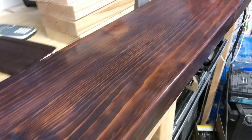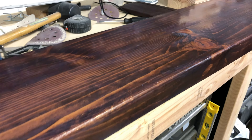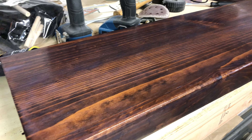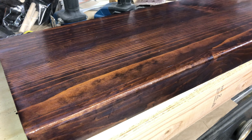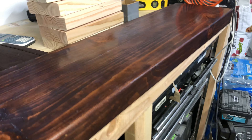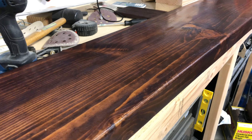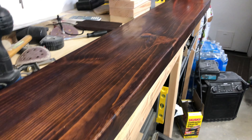I've added the second layer, so now I'm going to wait for this to dry. I've noticed that the second layer tends to dry a lot quicker — I like to believe it's because the first layer seals the wood, so the second coat is going on top of polycrylic that's already there, giving it more of a plastic feel that dries faster. Already you can see some shine developing — you can see the reflection of the fan. Because we're giving it a fine sand, we're also giving it a nice mirror-like finish.